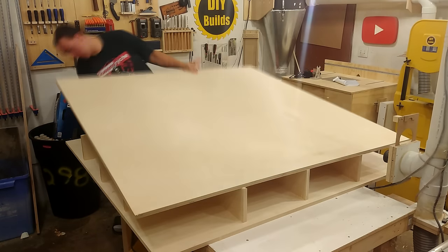The first thing I do is break down a sheet of 5/8 MDF. This is going to be the wall to separate the unused section of the lower shelf and the controls cabinet, which needs to be sealed off for proper airflow. The cross members that support the table run perpendicular to this piece, so I needed to mark out and notch out those areas. In order to mount this dividing piece, I'm going to use some scrap plywood with pocket holes drilled in it, which will get glued, nailed, and then screwed in place when the divider is installed.